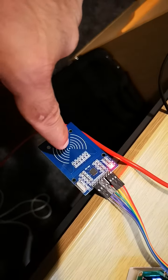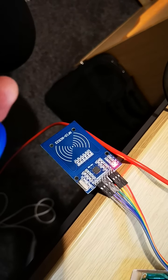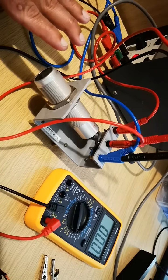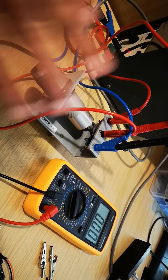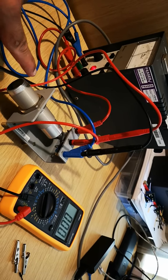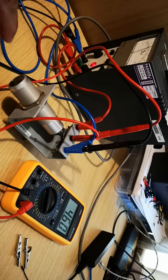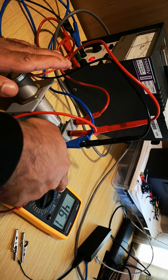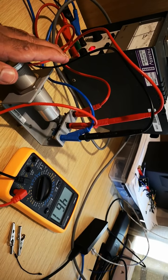And then you've got your RFID, you've got your receiver here, there's your tag. And then you've got your optical sensor. This obviously is not with Arduino. I actually had this lying around. It's an industrialized optical sensor, and this requires a high voltage just to power up. I managed to reduce it, minimize it, so it outputs just enough voltage for the Arduino.